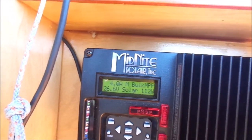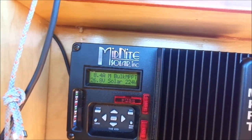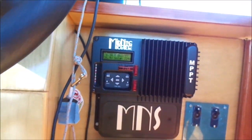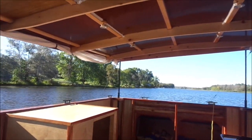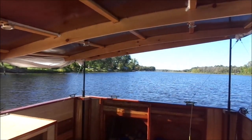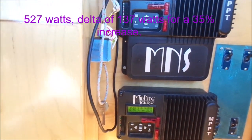I'm on the straight stretch. It's bouncing around a bit. With the canopy flat: 224 watts on one panel, 166 watts on the other. That's a good angle now — it's probably about 7 degrees or so. Let's see what we're getting: 294 watts on the top, 233 watts on the bottom. So a pretty good increase.